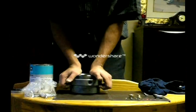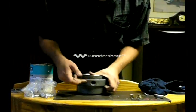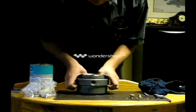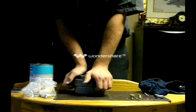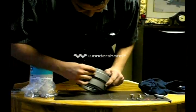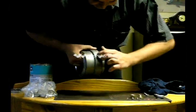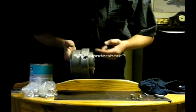That will give you them in place. You will see that there are two big grooves in the inner housing and on the outer housing — two grooves that should line up with each other so that you can install the roller pin balls. You will slot them in there and they will move around. Slot all 31 in, into the circle.